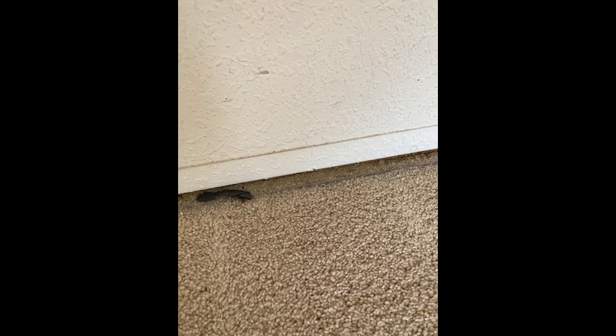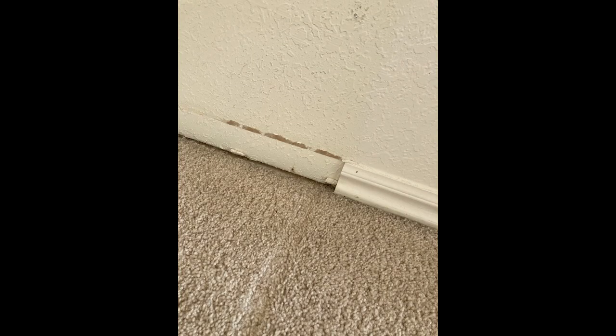Now, the parts we don't think of — and it was fascinating to learn about. When drywall is installed, it often doesn't go all the way down to the flooring. There's usually a small gap there, covered up by your trim, baseboard, or molding. That tiny inconsistency is a place where sound can more easily travel, as well as potentially air, so that needs to be dealt with. Finally, the electrical outlets — they're full of holes and are an easy place for air to travel in and out of a room, and therefore sound. According to John, it's pretty startling the difference in sound leakage an untreated outlet can have.